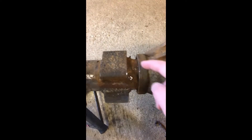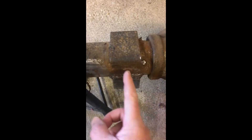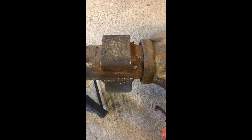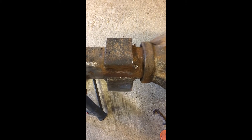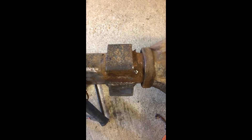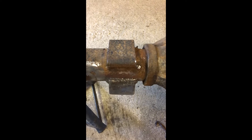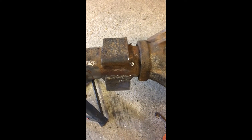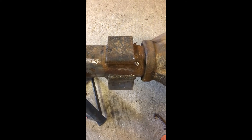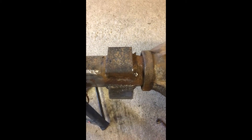I've also cut away about roughly a centimetre of the bump stop mount, because originally this was wider than the new mount and the new mount wasn't central to this bump stop mount. The leaf springs were fully in place with their poly bushes, there wasn't any left to right free play in them, and this was the position that the axle wanted to sit. I don't see the benefit of putting preload on the springs by welding the new saddles central to this, so that I then have to force the springs inwards to get the axle to sit on them — that's going to affect the suspension operation and significantly reduce the life of the spring bushes. So it was easier just to cut away a section of the spring mount.